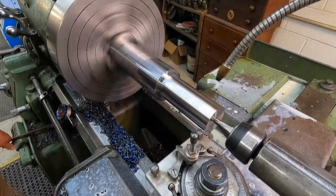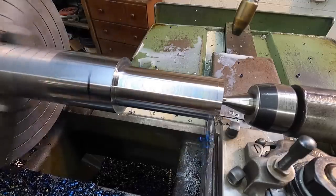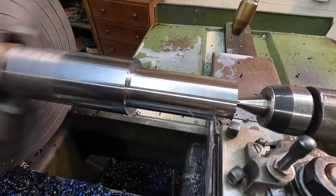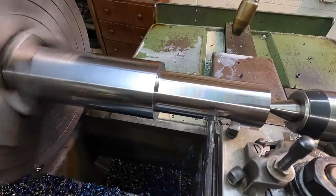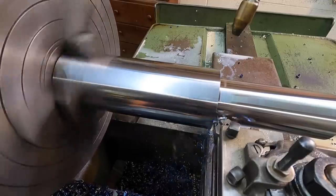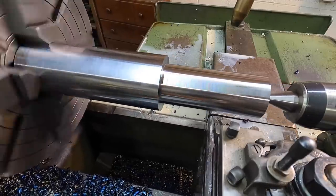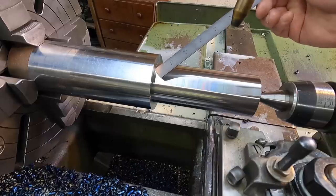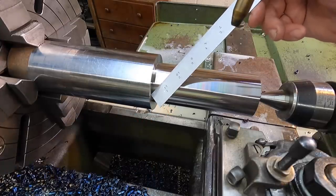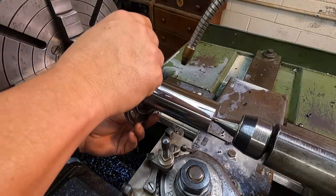You're always playing a game with yourself, trying to shoot for the exact number you want. I'm going to redo that face — although it cleaned up, I want to get our undercut in there first and then touch the face up. I want a nice smooth face without a high feed rate across it, as smooth as we can make it. Let's see if I hit my number, overshot it, or what.